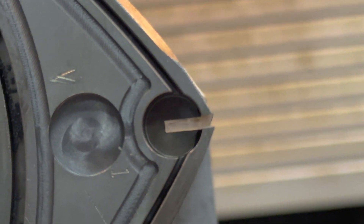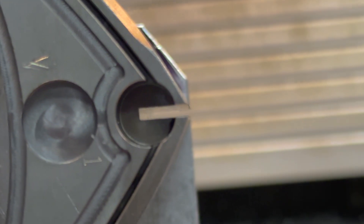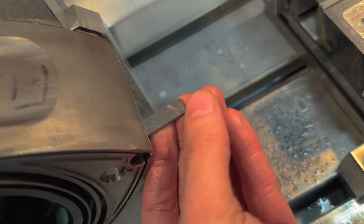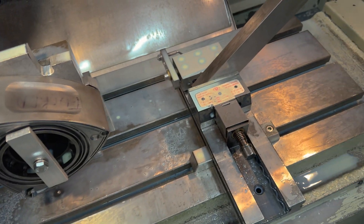This will work perfectly. The finish in that slot - I cannot complain about it, it's absolutely excellent. It is now 9.8 mil deep as it needs to be. I have a set of slips here which is 2.03 - not 2.04, that is 2.03 - because 2.04 was the standard fit.